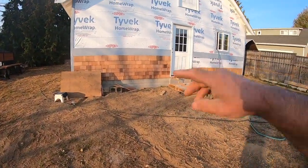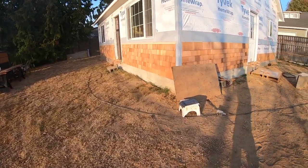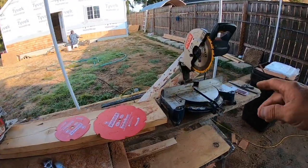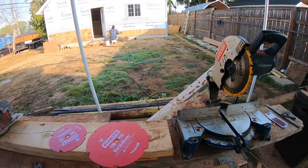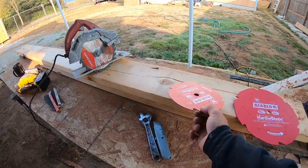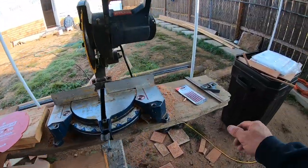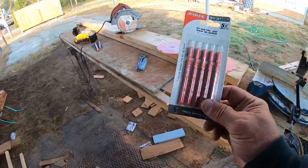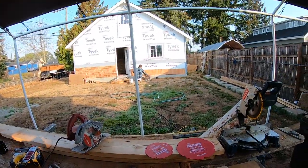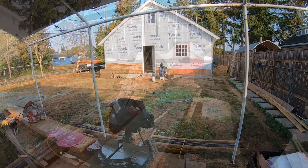This is where we finished up today on the siding — we got the front shakes pretty well all done. We ruined a couple of blades sacrificially cutting some of that hardy board on the back, so I went and bought a real hardy blade for the chop saw and one for my skill saw. I also bought some nice bimetal blades for the jigsaw, so we have the right stuff now to start cutting the hardy board efficiently. Going to get started changing these blades and fitting in a couple of those pieces.